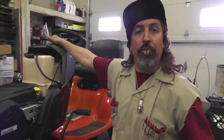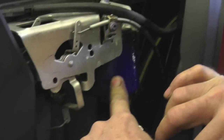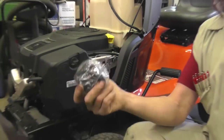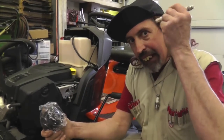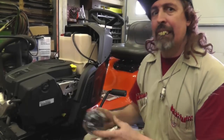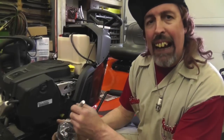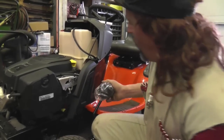You're going to want to change the oil too — that's very important. Depending on use, anywhere from 50 to 100 hours you'll want to change the oil. This tractor has an hour meter, which helps because there's no odometer like on a car. When you put on a new oil filter, write the date on it — or write the hours and the date — so you know exactly when you last changed it. Otherwise you forget. The date might say you changed it in 2013 and that's two years ago.